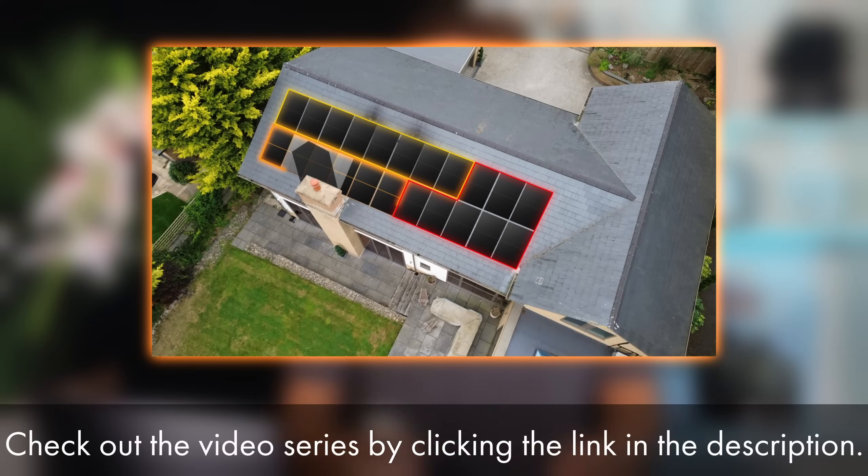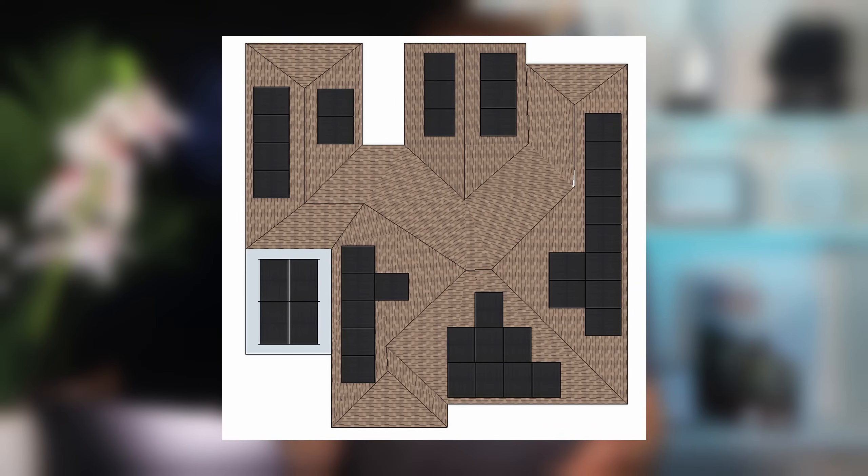Six MPPTs will be a bit overkill for most people. However, let's say you have a standard solar array with a chimney in the middle causing shading for a few panels — a bit like my client Sam had in the case study we filmed. With six MPPTs, you'd be able to put two or three panels on their own string and very cost-effectively mitigate the shading issues from the chimney, without needing any panel-level electronics on your roof. Another use case would be a complicated roof with lots of different dormers and gables, much like the one on screen now. Usually you'd have to pay a premium for a microinverter system like Enphase, or an optimised system like SolarEdge.